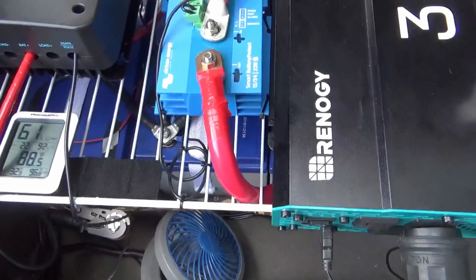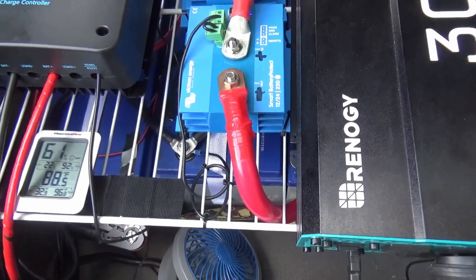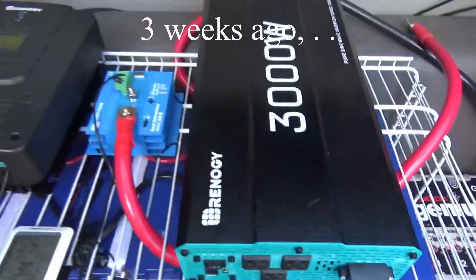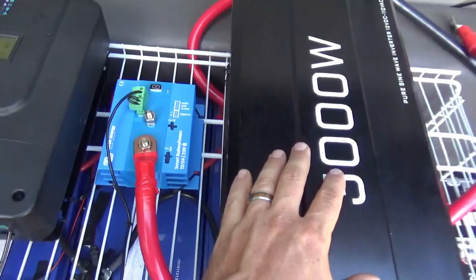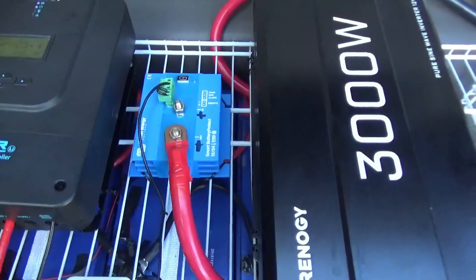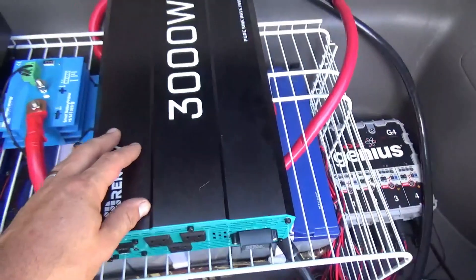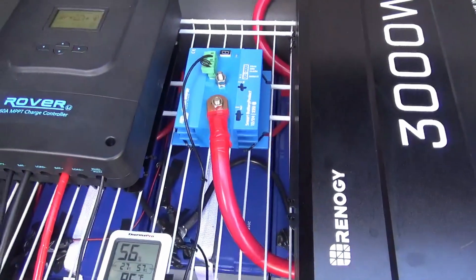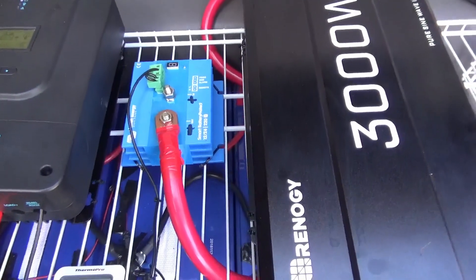I had a theory — that was my theory the first time I tried this — for why it wouldn't work. I'll roll that clip now. I think what's happening is as the inverter kicks on and starts pulling current through the battery protect, the battery protect constricts the current flowing through there somehow and causes the inverter to read like it has a thinner gauge wire running to it, and so it throws up that fault signal. I had an idea for how to work around that, and my theory was correct, and here is my fix.